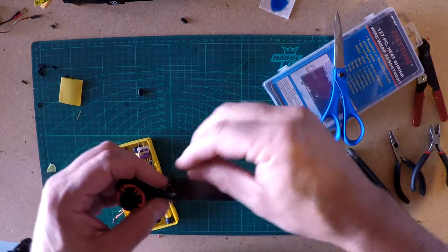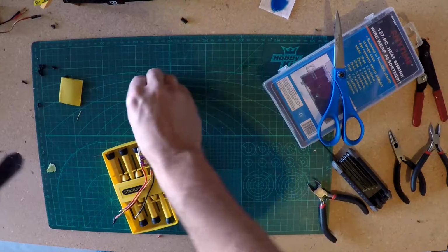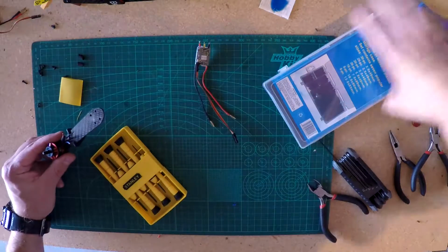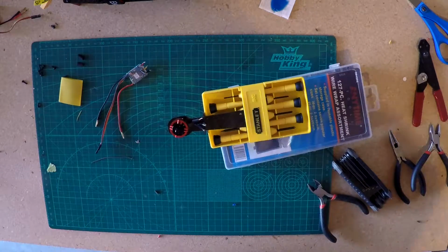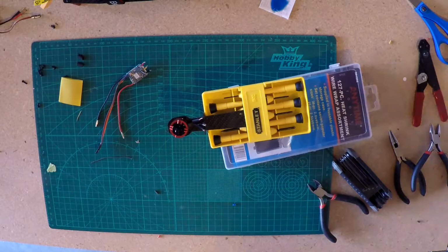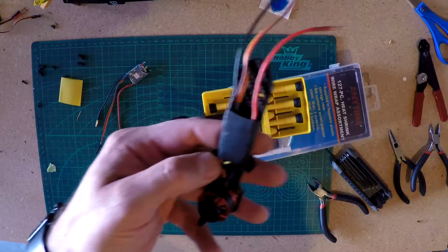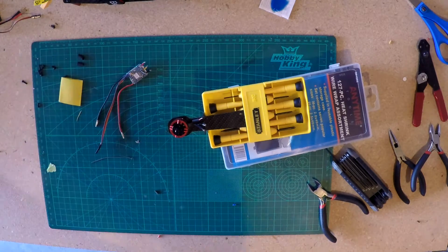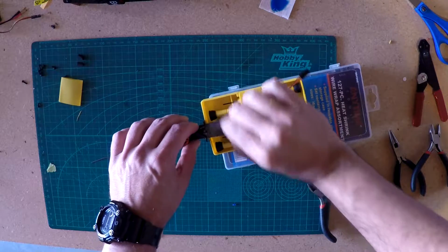I've had trouble with this. I've had to redo a couple joints because when I get done soldering the connections together, my heat shrink has shrunk, and then I can't move it down, so I have to unsolder and resolder to make it so that I can cover it up. I don't see anybody using electrical tape, but I don't know if there's a reason you couldn't just wrap it in electrical tape, particularly considering that you have heat shrink here that you could just make large enough to cover that. Well, I guess that'd get in the way of the landing gear again, so. But you could move the whole thing down a little bit so that you got it under. But I don't know. I'm trying stuff. Tell me.